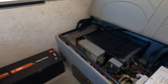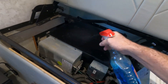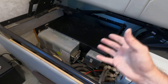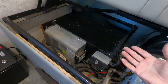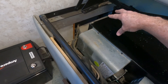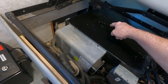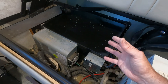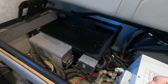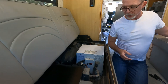If you've been watching me for any amount of time, you know that being clean is a big deal, so I'm going to clean this up first. Then I'll get the components and start laying them out to see where things can go with proximity to what they need. The wiring for the power is coming in from here, which means the breaker has to be somewhere over here; the bus bars should be somewhere centrally located. I want to make sure that everything is wired efficiently — the inverter has to have power from the bus bars too — so I'll just lay things out without attaching them first.